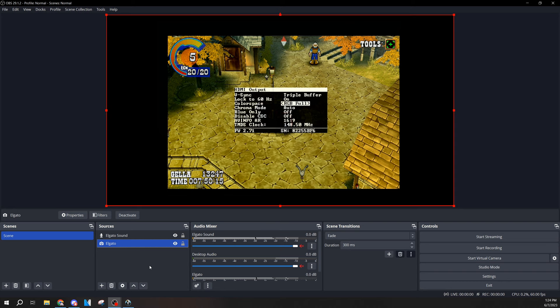This also further prevents image drops whenever a switch to a different refresh rate occurs. For the color space, you want to keep it at full — there's no reason to use limited nowadays unless your monitor is ancient. When it comes to inputs, the most important ones are the YPbPr and SCART RGB at the top. You can also use composite, but if you have this device you really don't want to waste its potential on composite.